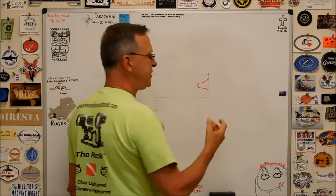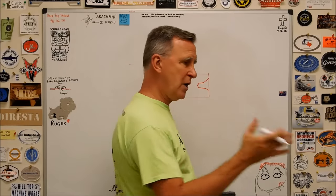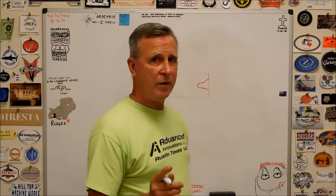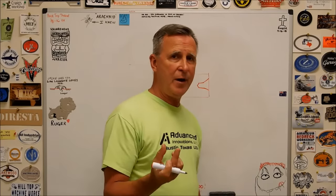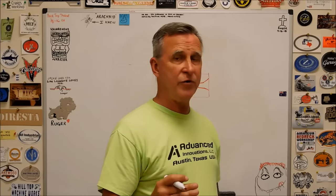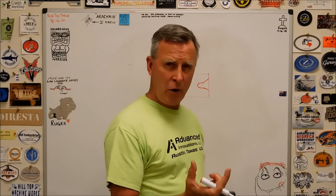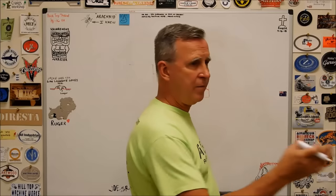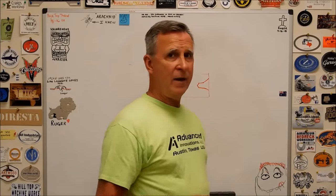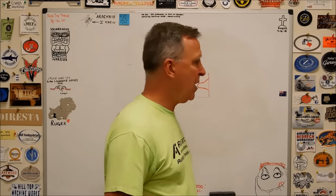Put a hole in here that is close to the size of the hole that you want. Don't go full guns and say, I'm just going to knock this right out of the park. Don't do it. Use a stub drill. Important: use the shortest drill that you can get away with initially. To drill a deep hole, you don't use one drill. You use several drills. As you get deeper into the hole, you change the drill. Put a little bit longer drill in there and use the amount of flute that you have on that, and then put a longer one in, use the amount of flute that you have on that, and then go for the throat with the deep one. Don't start with the deep one first. Have several. Make sure they're sharp.